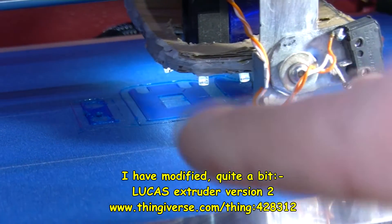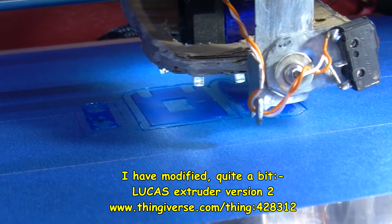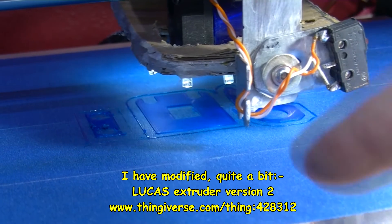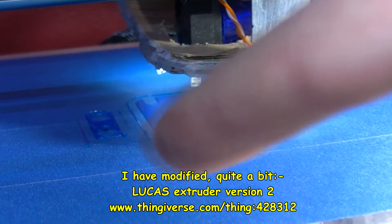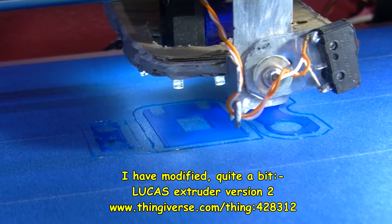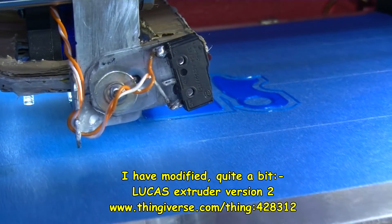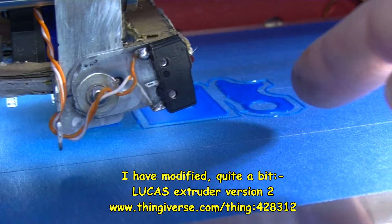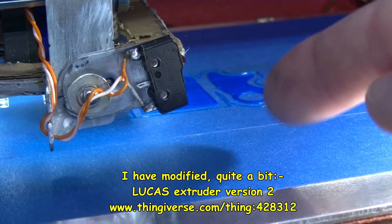See the two slots — those are for the two balls that go in. This one is like a peg that goes in that round hole there, and the balls actually go through that. It sort of clips on and will open out here to lever this lever up. That will lift out the two balls from the two slots, and then you can reasonably easily change the filament if needed. I've modified the original STL file provided by somebody else and put the slots in. I've changed the shape because on my feeder it does have a ball race, so I've had to put a bit of a dent in there and pad it out on the other side.